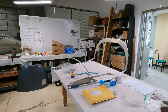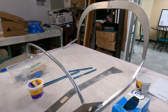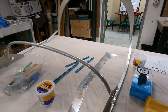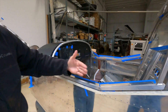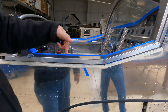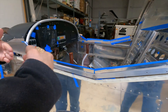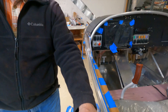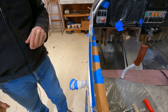The work involves first putting the frame on, getting it positioned correctly, then installing these angles. To make sure the frame is positioned correctly, you're given some blocks that help set the proper dimension angle for the rear bow on the frame to the roll bar on the airframe itself. To install the angles, the frame itself is curved, so these angles — which are straight when you receive them — require some fluting on the inside to get the proper curvature so that they follow the curvature of the canopy frame itself.